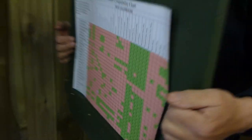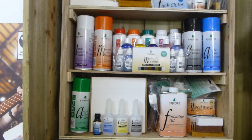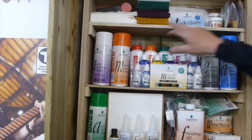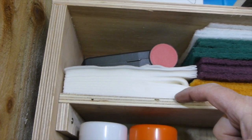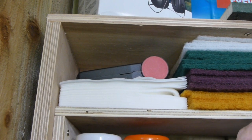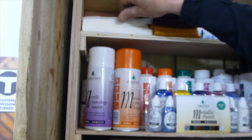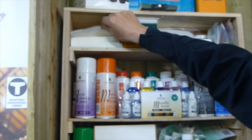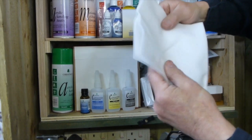So there's the cupboard for the Chestnut products. We've got safety cloth on there. You must never use real cloth — real cloth can be dangerous if it gets caught in the working mechanisms of the lathe. This is safety cloth, so it's paper-based and it will tear if it gets caught in any of the projects that you do. I'll just take a piece out there. That's used to polish the material.